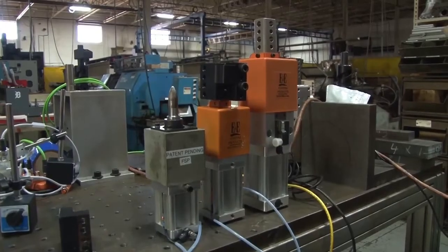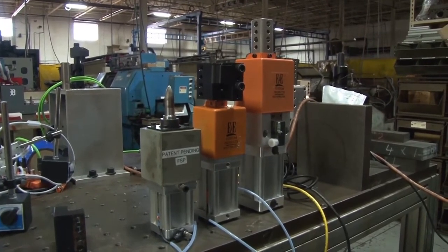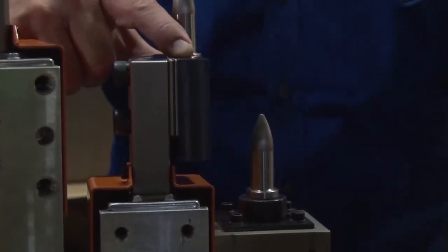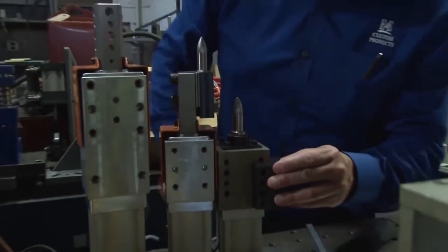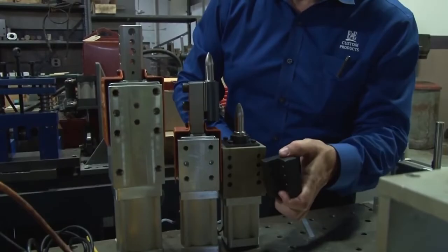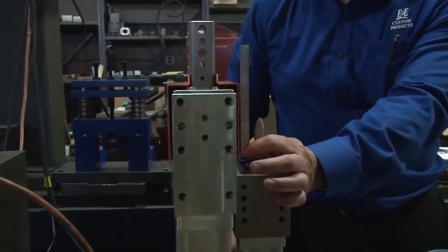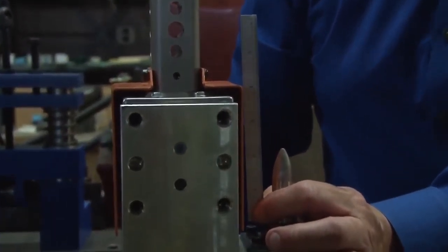The FSP is 4 inches shorter than a small shot pin. We moved the L block and shimming to the body to further reduce the package size. The FSP is 7 inches shorter than the standard shot pin that it is made to replace and is half the weight. The size advantages for trunnions, dial tables, and end effectors are obvious. It is our opinion that the FSP will replace traditional shot pins in nearly all applications in the near future.